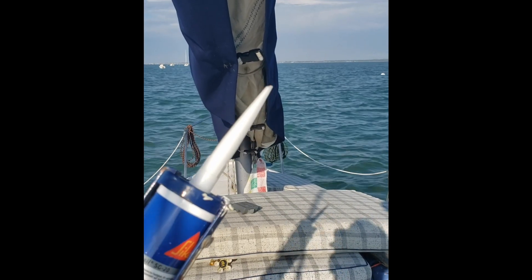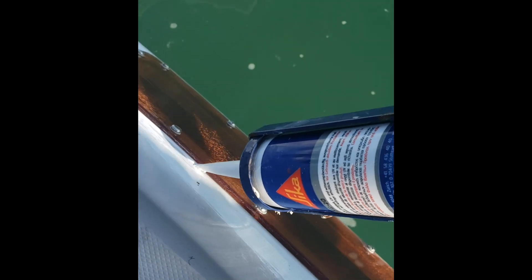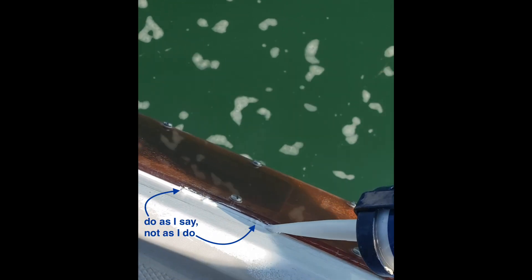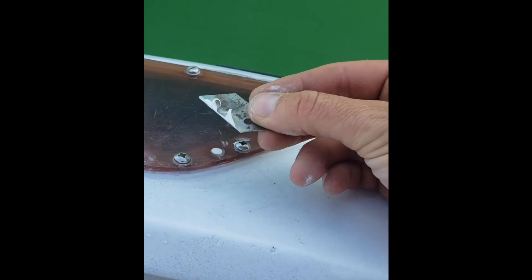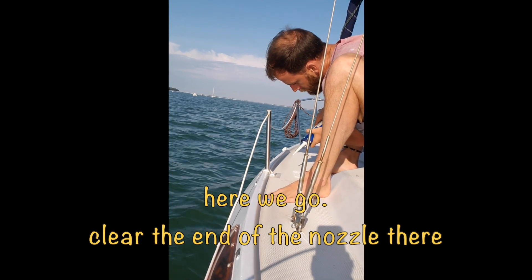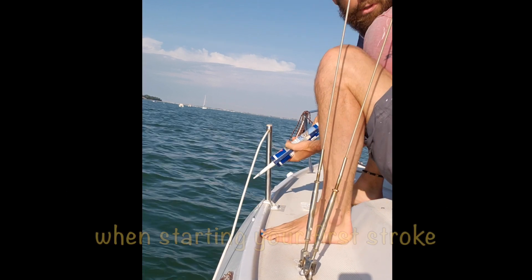Just going to do some silicone right now. When I'm laying beads like this, I try not to stop once I get going. There's going to be mess either way, but I find the little humps left by stops make it messier than necessary. You want as little remnants of silicone at the nozzle end as possible when starting your first stroke.